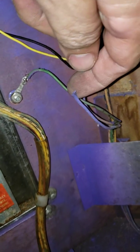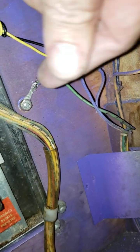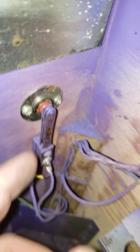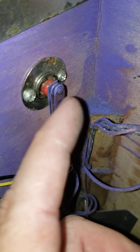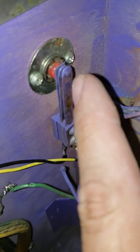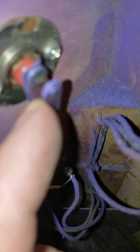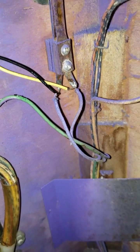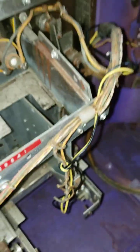One of the issues we've been finding is wires that are unsoldered. This ground wire here — we found this one completely loose. We also noticed that some of these machines are painted inside and out, so sometimes paint gets stuck in between these tungsten components so they don't touch the way they're supposed to. These little connections get really dirty — you can see a little bit of paint fell inside there. This thing's been sitting for a long time from what the owner was telling us. What we did is we renewed the wire — it had a break in it — so we just took it off and connected it directly to the back of the coin door.